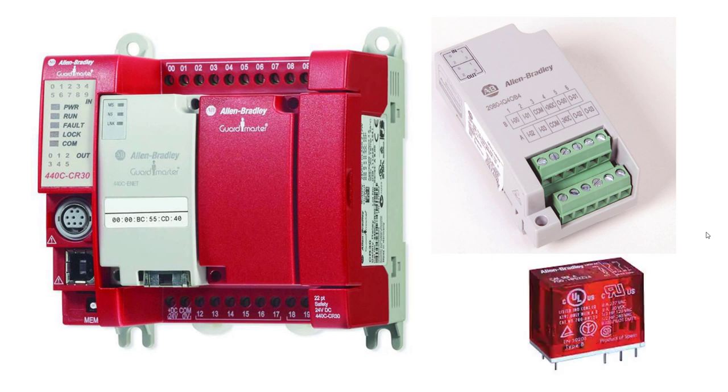There are two types of safety contactors or contact relays. The ones I have behind me that are hooked up to my personal CR-30 are high-current contactors with another set of safety contacts — all force-guided contacts, meaning none of the contacts can move unless they all move. If one is welded in position, you cannot change the position of any of the others. That's what gives you your two-channel capability in the safety circuit. We're using about six of these little red ice-cube relays.